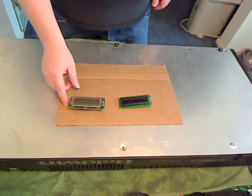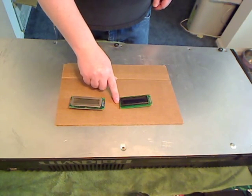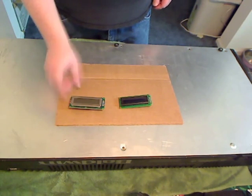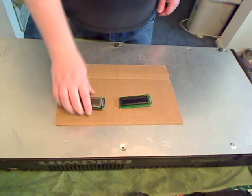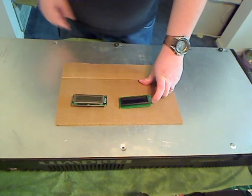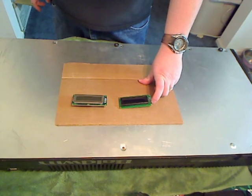You'll notice here two pins. There aren't any pins on this one. That's because those are for the EL backlight, and this doesn't have any backlight at all — it doesn't need it. The 14 pins are the same on the other side. You'll notice there's two pins that are not used, and that's because those would be for an LED backlight on an LCD-type display.